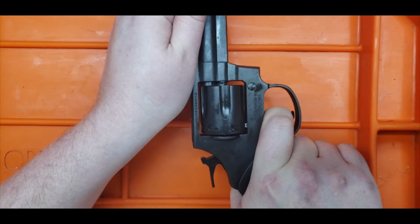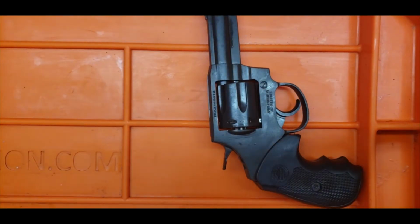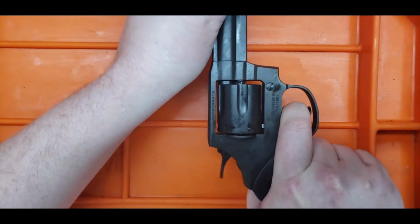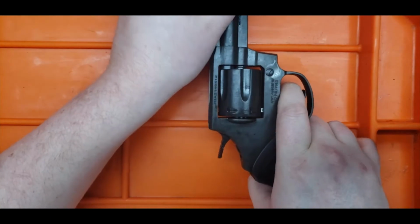That's the same one right there. Boy, that is not great. And just, man, the pull there goes up to a good 14 pounds. That is not a great start. But, I mean, it goes. But you saw a couple of, oh boy, my wrists are sore already. So, I mean, it'll go. It goes bang. But that indicates excessive cylinder wear.